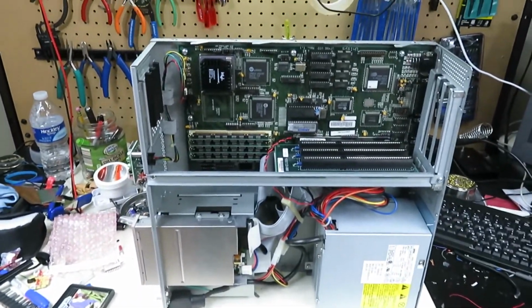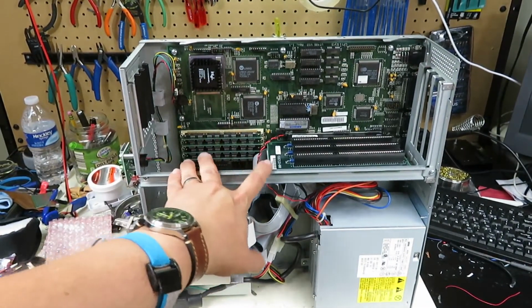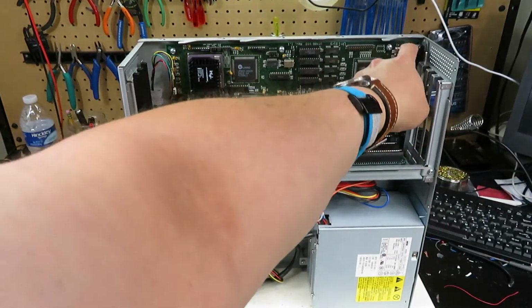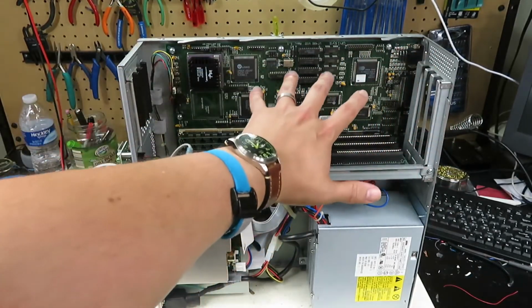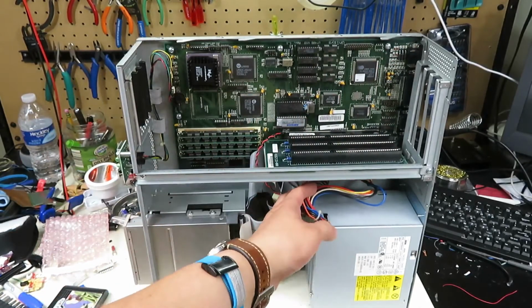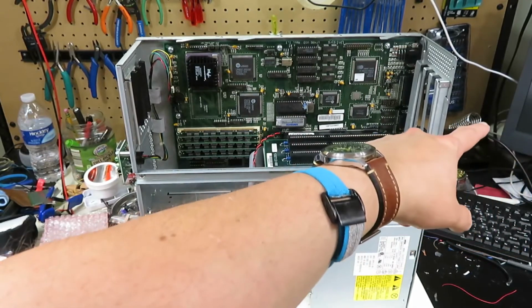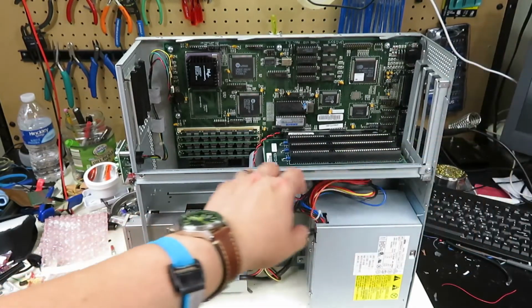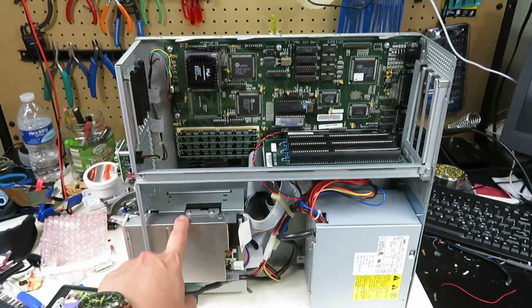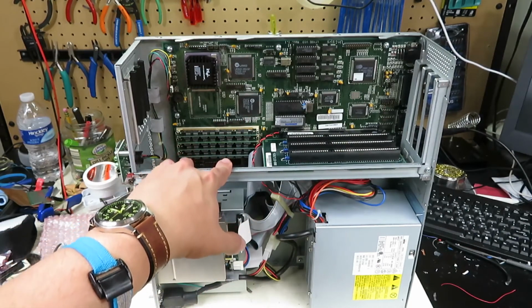So yeah, thanks for watching, and next video I'll show pulling this bracket out, and then I pull this whole motherboard out to access the bottom of this, so I can just desolder it, put a new one in, and I'll power it up one more time at least, and have it hooked up to my monitor over here. It's got dual inputs on it, so I hook up the VGA on there. I can look at the output in there, and that'll be it. And if I don't see any more waviness, that's about all I can do. I'm not a miracle worker.